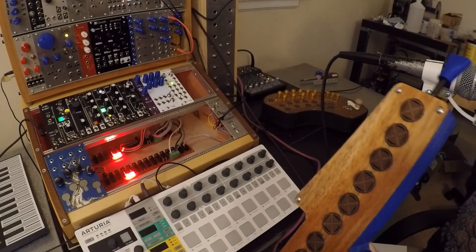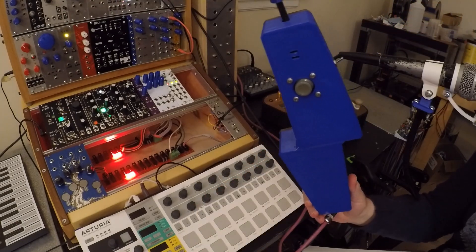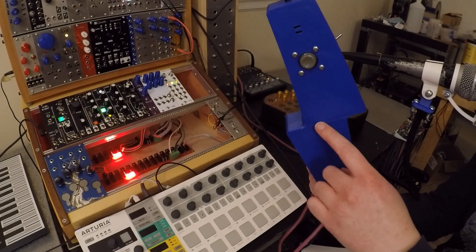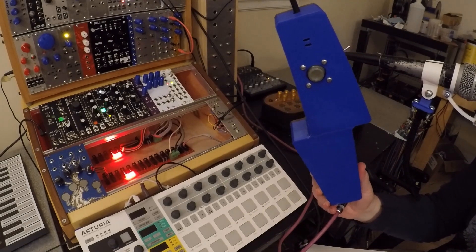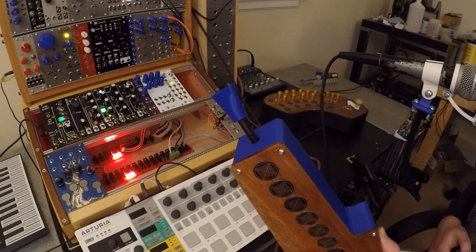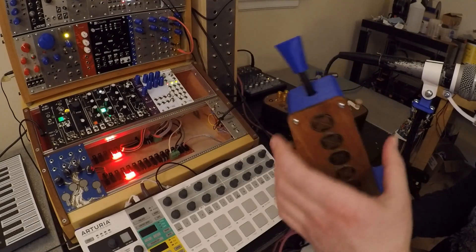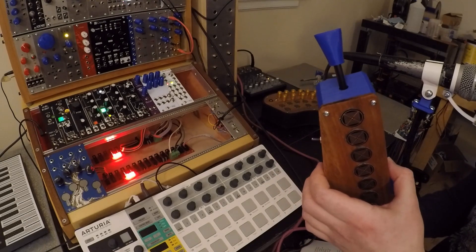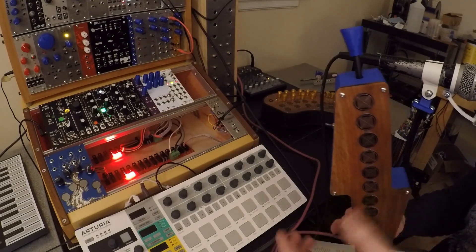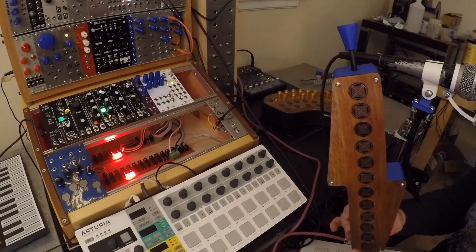The case for this project is a 3D printed tub and I've got a mahogany faceplate on here. Due to the size of the instrument I had to print the tub in two parts and epoxy them together. I've seen there's a special glue for PLA but I haven't tried it — epoxy works just fine here. The mouthpiece is also 3D printed and I sized everything for vacuum tubing from the hardware store. The key with this tubing is that it has four tiny holes, which allows air to actually escape since the pressure sensor in here is sealed. If you don't have enough airflow it makes it hard to get a breath in while you're playing — or maybe I just don't have good technique; I've never played a real wind instrument.